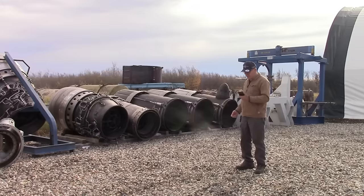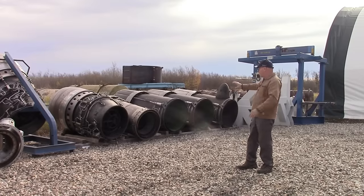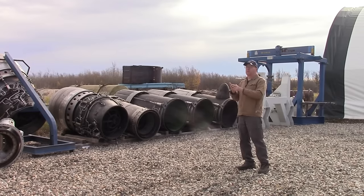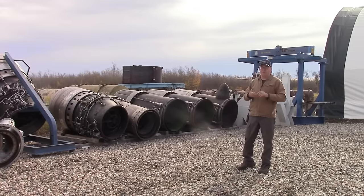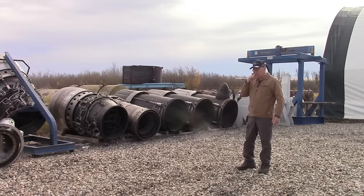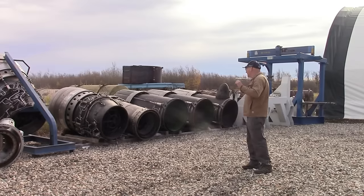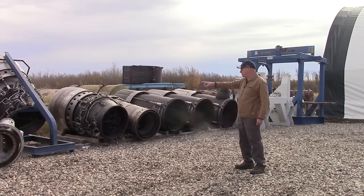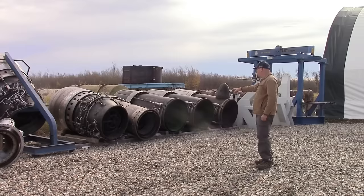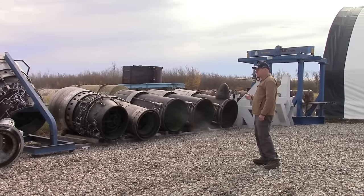A couple of small details worth noting: there is no combustion chamber shown in that video — we only showed the afterburner jet pipe. So by 'combustion chamber' he probably means the area in the jet pipe where the fuel burns. We're going to come look at it more closely. We have a bunch of afterburner sections here — these are from a Rolls-Royce Spey, this one is from a GE F404, and the last three are the GE J79. The one on the end doesn't have the liner.